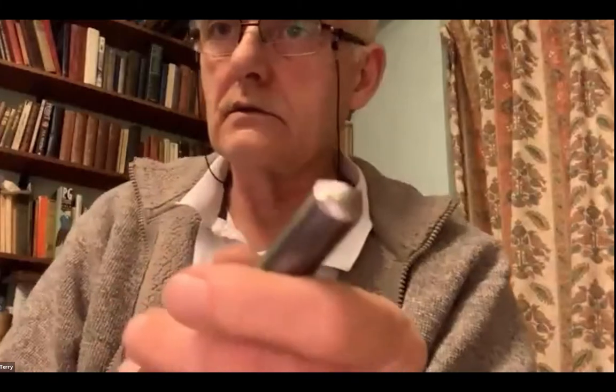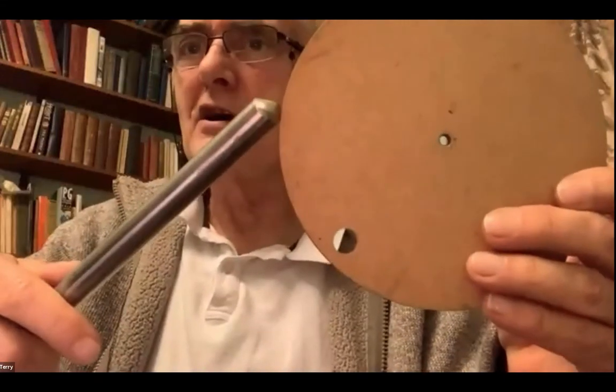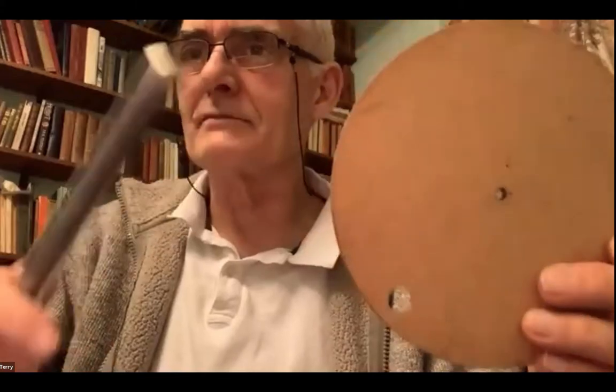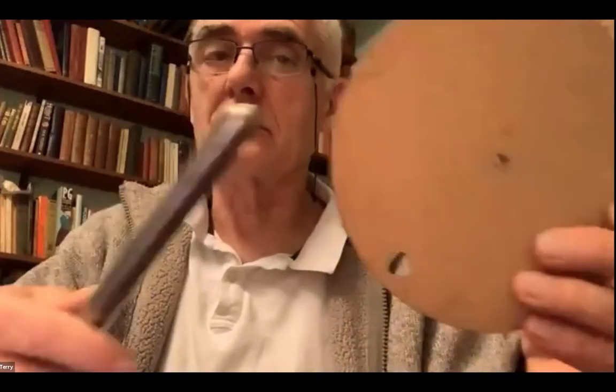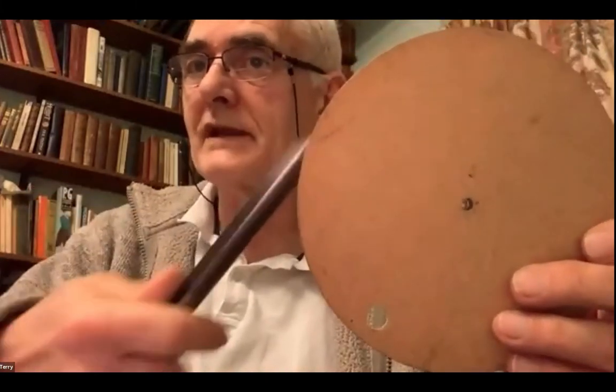You support the tool in your hand, hand on the tool rest or some sort of fixed reference point, hold the tool in your hand. It's the gouge. And you offer it to the wheel, and you sort of learn the angle. You've come to know the angle. Also, you could feel the angle on the stone, the bevel, and you sort of roll it and push it upwards like that. And you do it completely freehand, similar to the way I was using that honing wheel earlier.